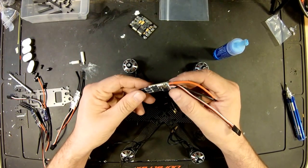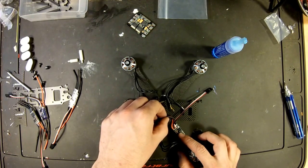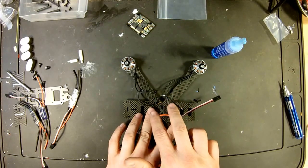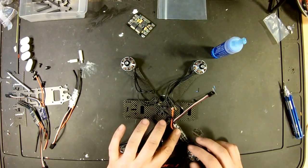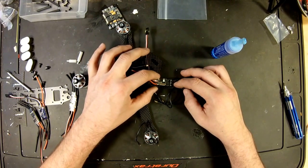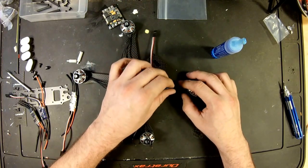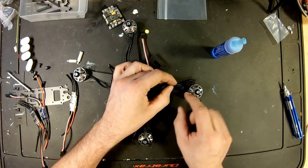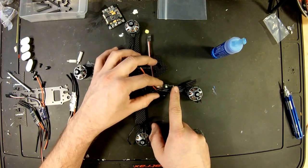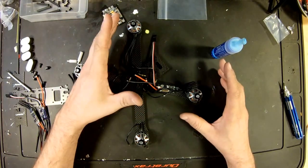And at that point, that's pretty much all I'm going to do for now, and get our wires ran to where we need them. And then that way, we'll cut everything down to size, get our ESCs soldered onto our power board, and then put heat shrink over top of our ESCs closer to the center. And with the heat shrink closer to the center, we'll shorten up our motor wires, get our motor wires soldered into place. The Lux flight controller now is able to do the BLHeli pass-through, so it doesn't matter. We'll just get our motor wires nice and flat, solder them down, bring the heat shrink over our ESCs, shrink it down, and that'll be one arm done.